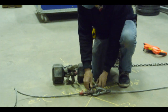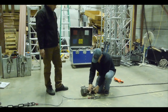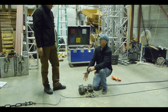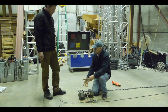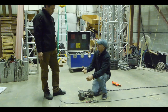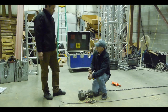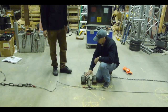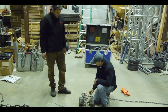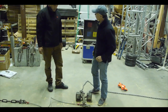What happens is on a chain for a Lodestar hoist, it's a pound per foot. So 50 pounds of weight is like pulling up 50 feet of chain. That's why I use a 50-pound weight here — I test the student's ability; if you can't pick up 50 pounds, you're going to have to get into the gym and start working out if this is what you want to do for a living. So now I have representing 50 feet of chain with this 50-pound weight, and the chain right here will be our plumb to see if we get it right on that spot.